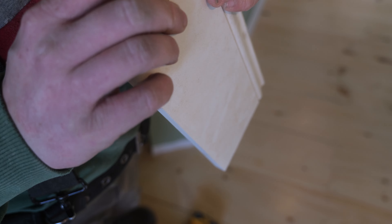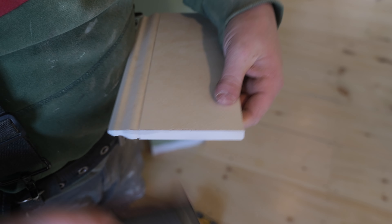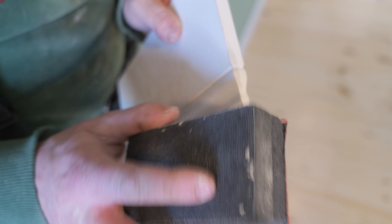Also, when you see me cutting this little piece and gluing it onto the end of my board where my fridge goes in, this is called a mitered return. It's a way to kind of make things look a little nicer than just a straight cut and also allow that trim to go around the corner.